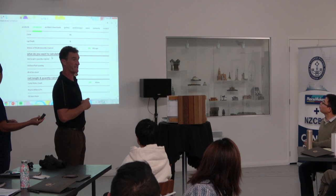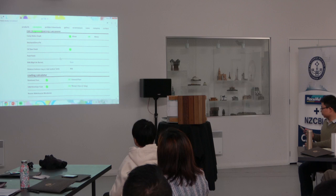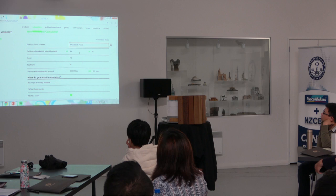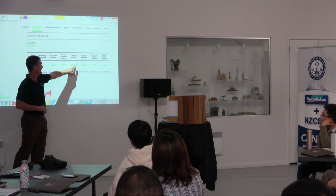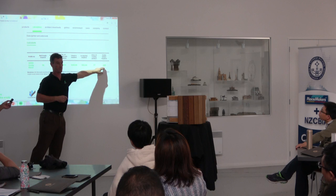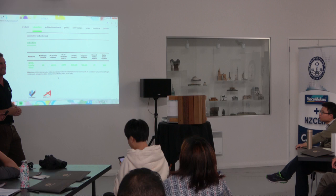It'll also tell you how many battens you need, how many nails you need, how many clinch nails you need. It tells you the size of nail, how many nails for that many weatherboards, the lineal meters you need, because you said it was 100 square meters, how many liters of stain or paint, and how many battens. So it actually helps you. Just go to the website and follow the instructions. You need to factor in some wastage, but it works pretty well.